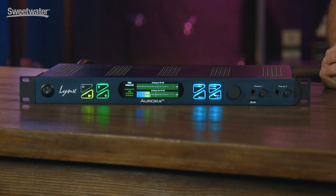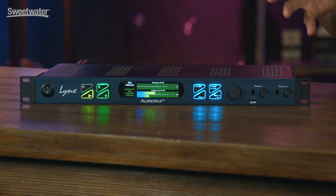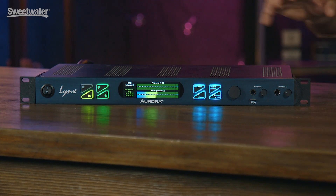We've also added two very high-quality headphone amps, so that it becomes a great monitoring opportunity for listening on headphones, and this great little micro SD recorder that will allow you to do up to 32 channels of 192K recording and playback. That's phenomenal for a couple of reasons. One, you can use it as confidence recording while you're in the studio. You can also use it if you're in the studio and don't want to power up your DAW and just simply have record.